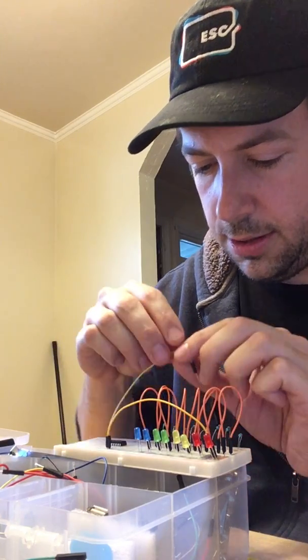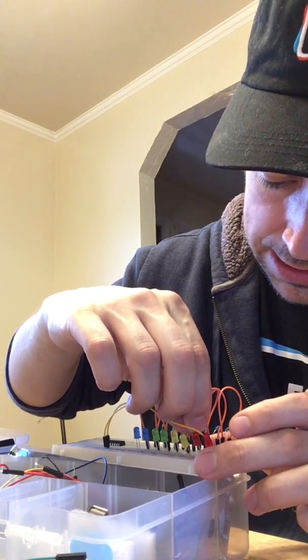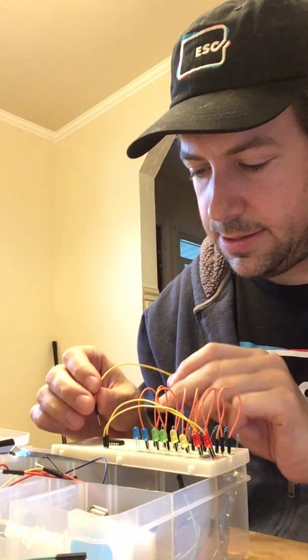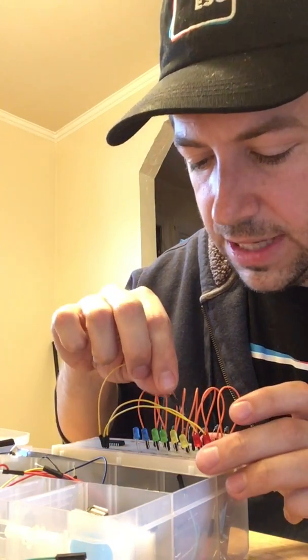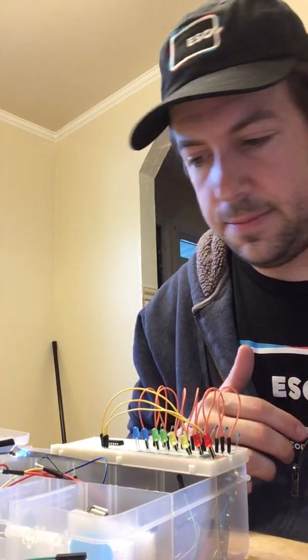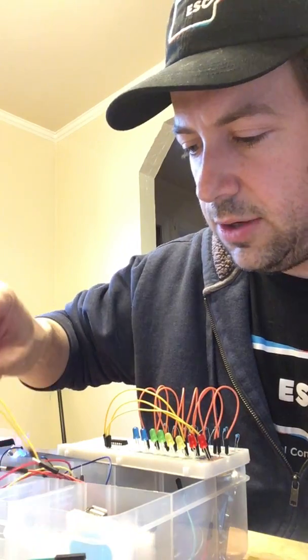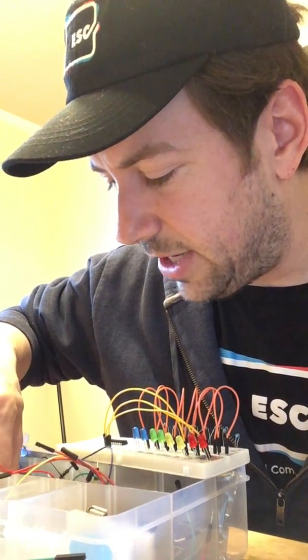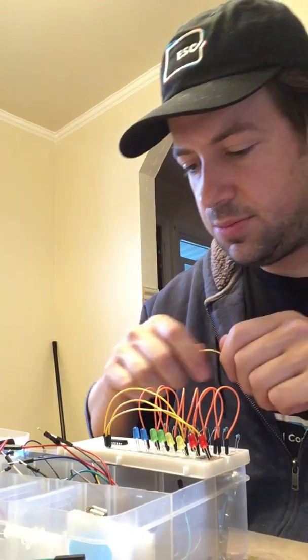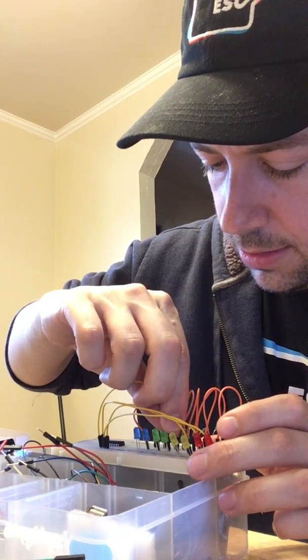So this one goes just over 1, and then we're going into basically the long end side of that LED. Now, the thing to remember about breadboards is that breadboards are just wire replacements. They're just ways for you to avoid having to solder a lot of wires. If you're building a real version of this to sell or as an exhibit, you probably wouldn't even use a breadboard. Breadboards are mainly used to experiment with, to quickly prototype something. Once you're doing something in the world, you wouldn't use pre-cuts, you would use the exact measurement and go directly from one thing to the other thing.